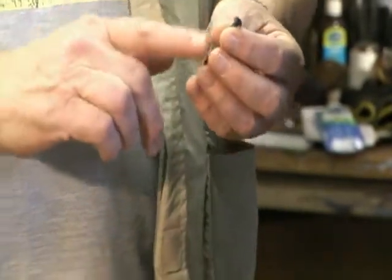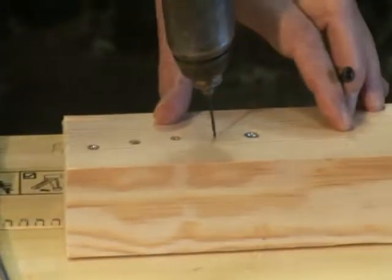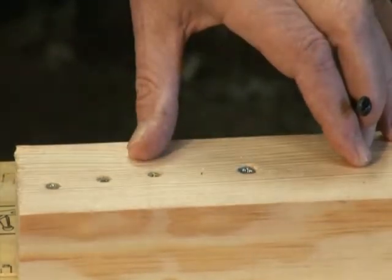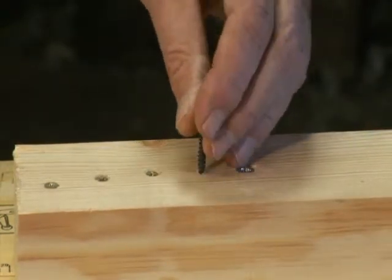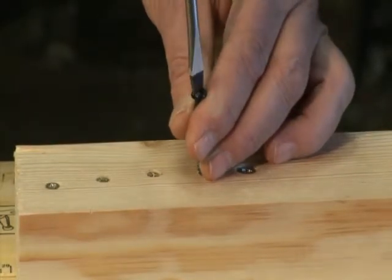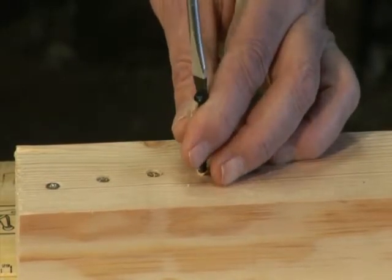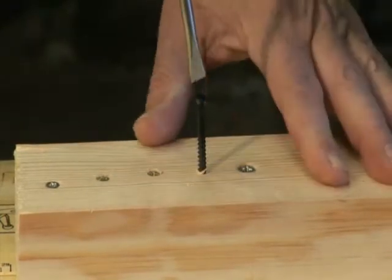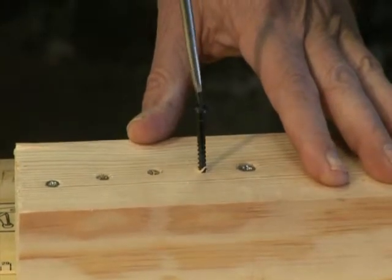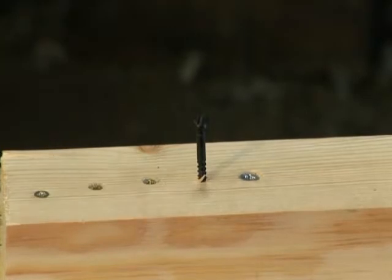Now this is when you do need a brad or a drill to start the screw off. So we will do the same as we did before. Getting a bit full up, that bit of wood. It's going to weigh a bit more than it did when it came in. Now, we'll take a large screwdriver and gently turn it. And then once it's set, you can then speed it up. But just take it gently, because you don't want to ruin the top of the screw, and you'll wear your wrist out fairly quickly if you do it with too much panache.